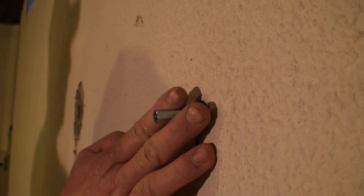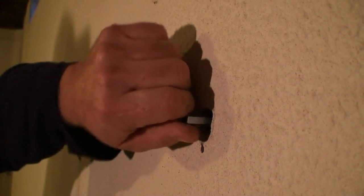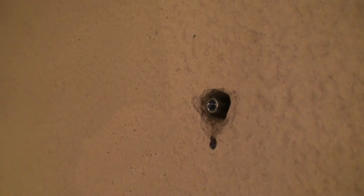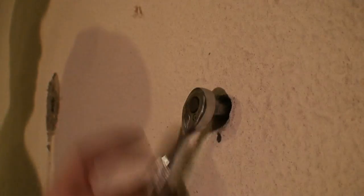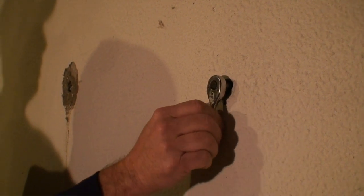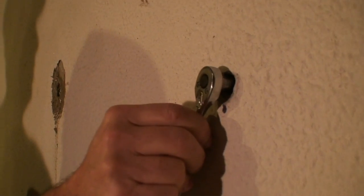Again, careful insertion to a snug fit. Tighten by hand if necessary, then hammer slightly to ensure it is flush with the wall. Here we use a different tool — a ratchet with a 3/8 socket will secure the TRX as well. Tighten the TRX to a snug fit. Do not over-tighten, as the water-activated shaft will self-tighten over time.